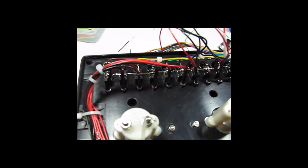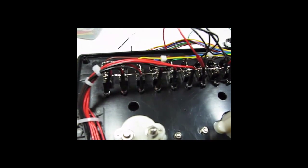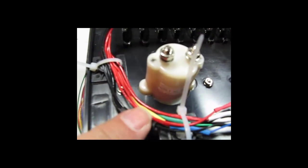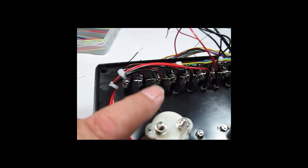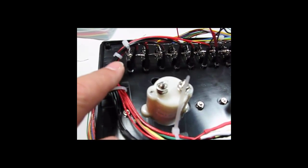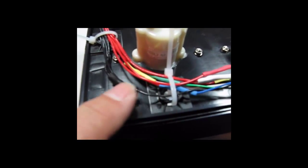Okay, you can see we have the red and black wires from the first 6 LEDs. We've done our wire management to the tie-down pads, and you can see that the shrink tubing falls in various places because this red wire is going to be the shortest when it gets here, shorter than this one. You could have cut them to varying lengths so all the shrink wrap fell in one place. That's probably not a good idea because then it becomes too bulky.